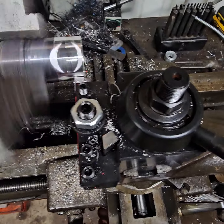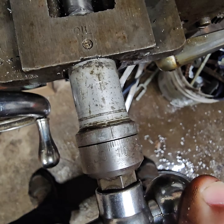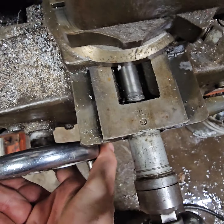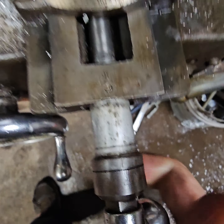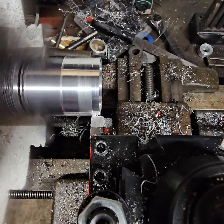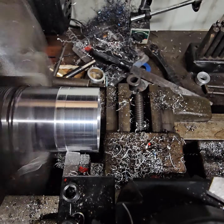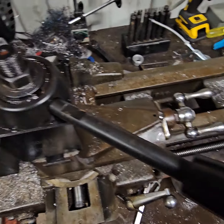Roll back the machine and go back to the number I was at, which I think was 20 or 19, but I didn't pay attention. So let's see. Yeah, let's take another 2 thousandths and take a deep cut. And by the way, this is the old broken Maglite flashlight part. You have to disengage that bad boy. You've got to be quick with it.